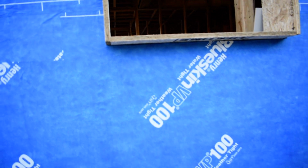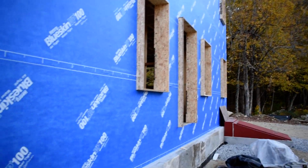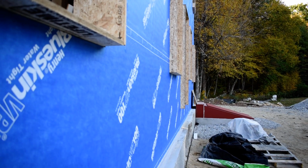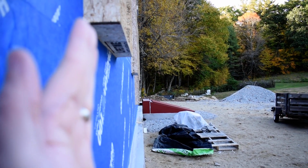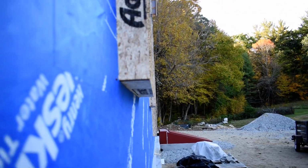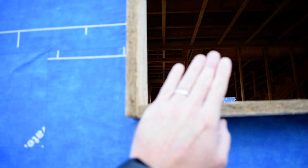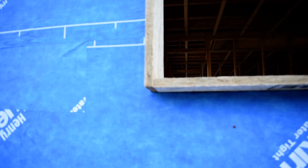So everything's super tight and it gets insulated from the back and all that good stuff, but all these openings are bucked out. Now the bucks are deeper over here. You can see they're like, I think, 4 inches over here, where they're 2 inches on the front, and that is because we wanted the buck to come right out to and overlap with the brick just a little bit, by about 1 inch, because again, 2 inches of insulation, then 1 inch of air gap, and we are going to catch the corner of that. That'll help as an alignment so that the brick is coming up to it, and then we'll have something here to nail against for the trim. The window frame will be here, and then a little piece of trim goes on the edge there.